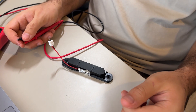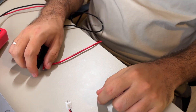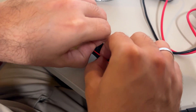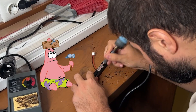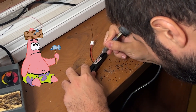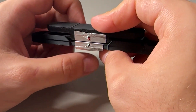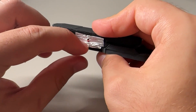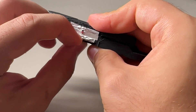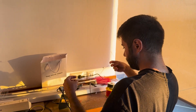I spent some time figuring out how to connect the JST male connector wires to the sensor. I first tried sticking the wires under the tape but the adhesive wasn't conductive. I also considered soldering but aluminum isn't really great for that. Eventually I used the holes as intended, passed the cables through, bent them and then folded the non-adhesive part of the aluminum tape over the top. I made four sensors and soldered four female connectors together in a chain to create one fully working button.